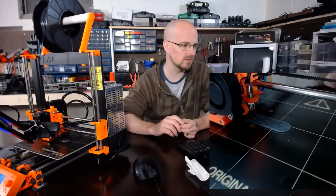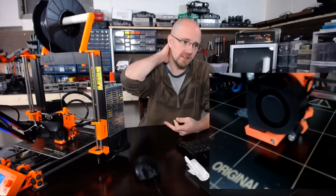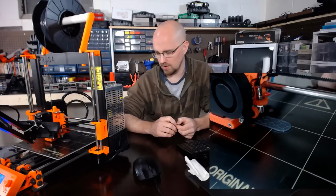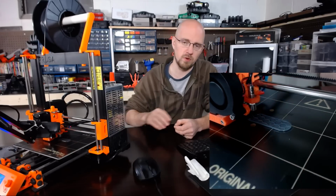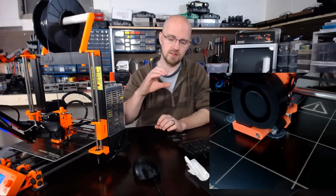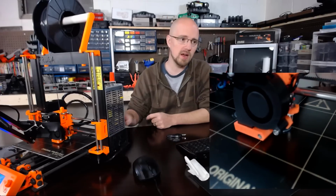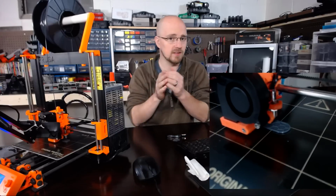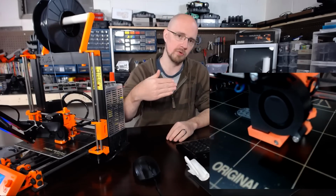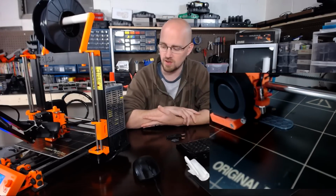I'd also like to. I would spin the machine, but I don't want to unplug it or do anything stupid. But in the group, I don't know if you've seen that conversation. We've been discussing the flex in that rear Y-axis motor mount, and if I do print any replacement parts, that's probably going to be one of the first things I address, because as it is, the stepper motors have 4 mounting screws on each corner. You can kind of see it on these front ones. And this rear bracket only attaches with 2 of them, and it just allows quite a bit of leverage on that back piece. And if your belt's even a little bit too tight, it'll kind of torque the motor and make it go out of square with the whole belt and everything. And I think that's some of the problems I was having when I replaced the bearings and took the belt off like an idiot.